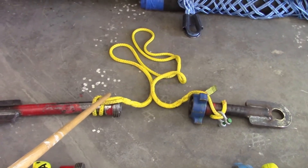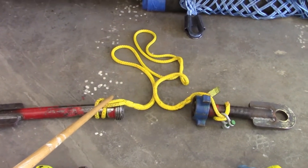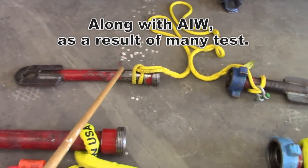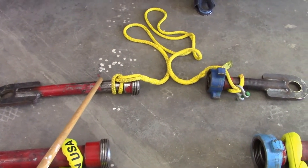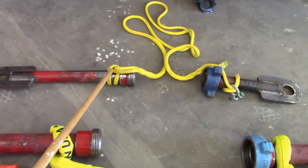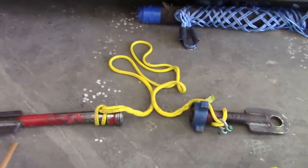This morning we are going to show you why the system failed. There have been a couple of good studies on dynamic loading of piping restraints, and the guys with the PhD behind their name say that a two-inch pipe failing at 15,000 PSI will produce between 44,000 pounds to 55,000 pounds of load to the restraint. So when this restraint is installed as per instructions, we're going to put it in a test bed, pull it, and the target load we are looking for is 44,000 pounds.